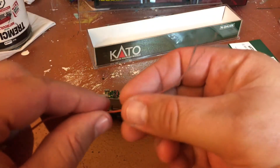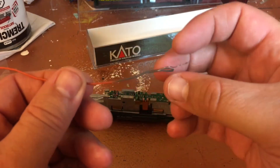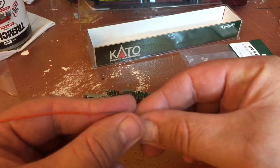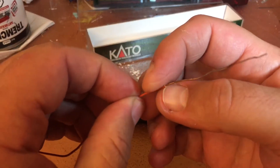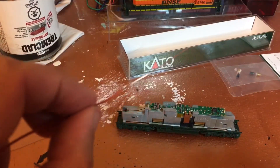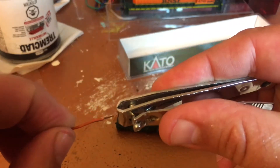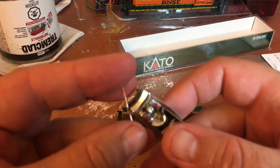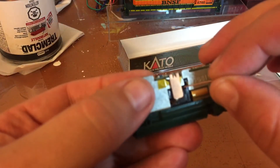All I'm going to do is use this piece of telephone wire to make a little contact strip. It's going to work between my frame and the lead from the motor. I'm just going to remove some of the insulation to give me access to the copper wire. I'll work on that off camera, remove a bit of oxidation using a steel wool, then cut the wire into two and install it between the frame and the contact strip for the motor.